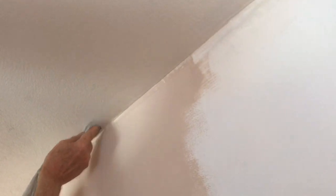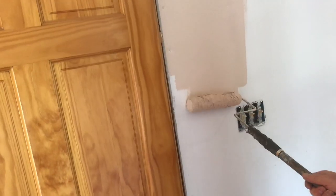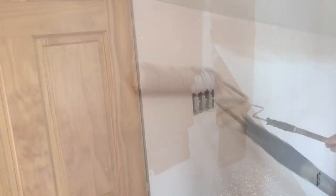Inevitably, a bug is going to fly into your paint — the best way to handle it is just don't touch the bug, let the paint dry, then flick the bug out. And inevitably you're going to hit the ceiling or somewhere you didn't mean to paint; immediately get a clean rag and wipe the paint off. It'll take some scrubbing but it's worth it. It only takes a little bit of time to remove outlet covers, and it makes for a much cleaner job — when you put the switch plates back on, everything will be nice and clean.